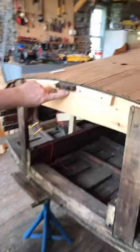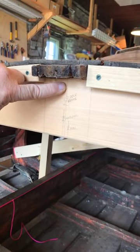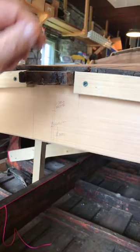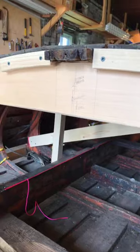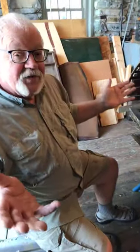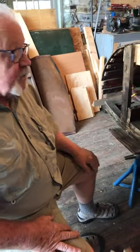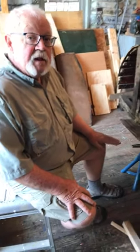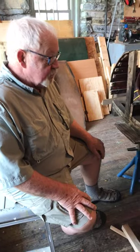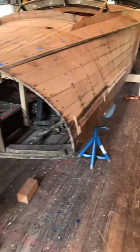This is a challenge. There were three center lines. The center line of the deck frame is here. The center line of the king plank is there. And the center line of the keel is there. So you decide which one you're going to use. I decided to use the first piece of wood as the center line, figuring that when a boat is set up, people are the most conscientious about what's plumb and level. Another challenge was, of course, the water line, which I've just described.